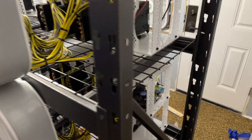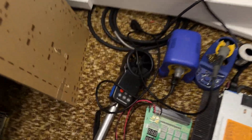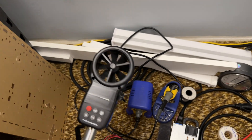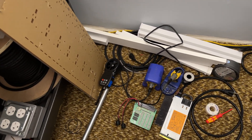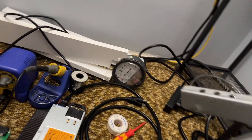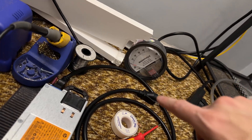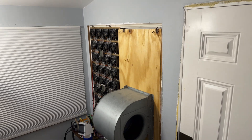I'm going to measure it with the same method I used in my other video: an airspeed meter on a stick shoved into the center of the opening. With that we can estimate airflow, assuming it's laminar and fairly even. We'll also measure the differential pressure in the building and, of course, the power consumption of the fan.